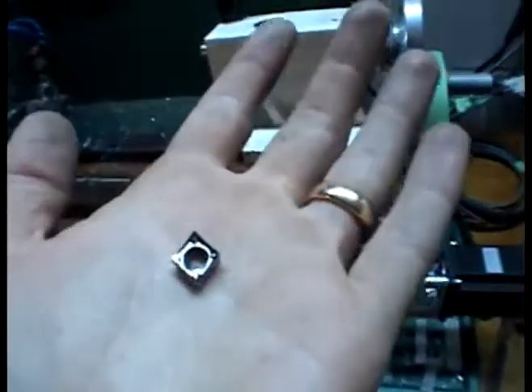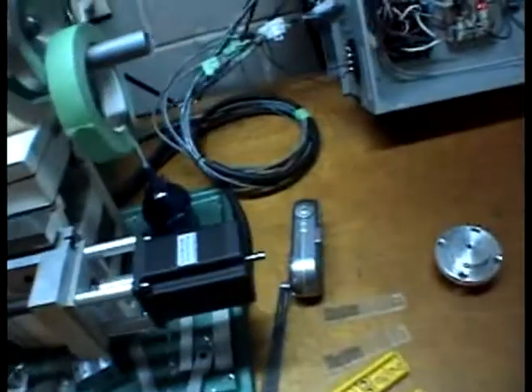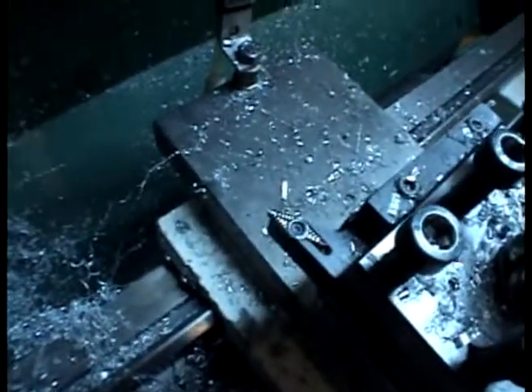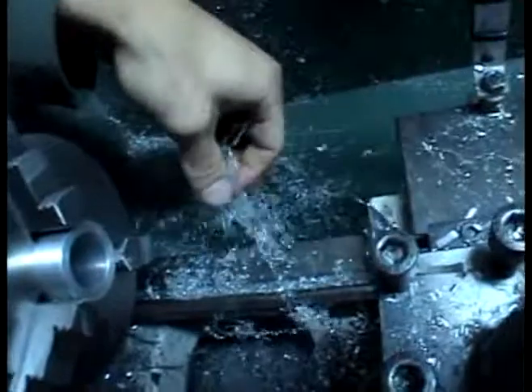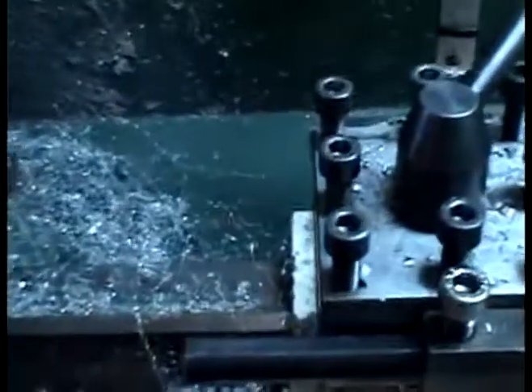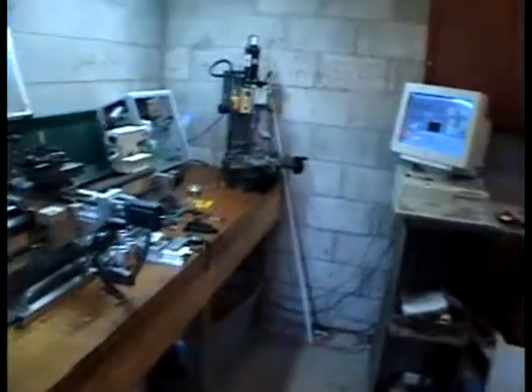They have a branch near me in Toronto. It's an aluminum insert — very sharp, very good. I noticed quite a difference between just the TiN coated inserts and these. I've got one on my boring bar and another on my 35 degree right hand tool. With coolant, you get these nice little stringy chips and a fantastic surface finish.